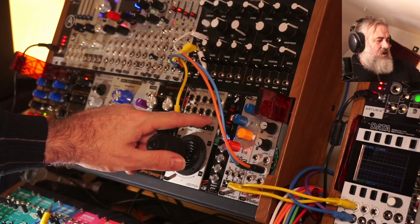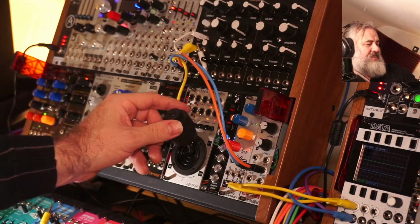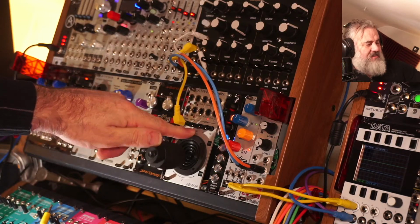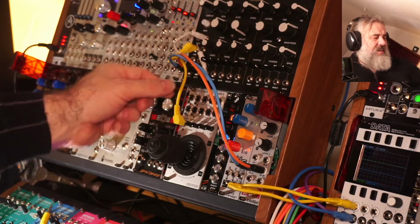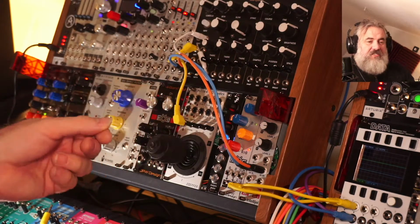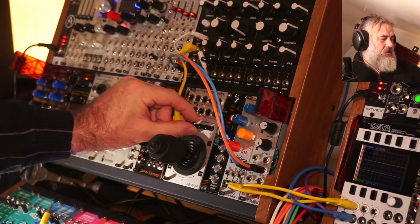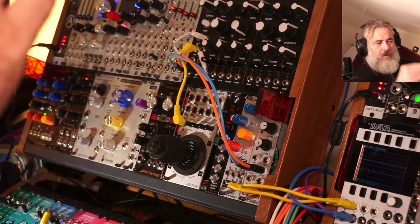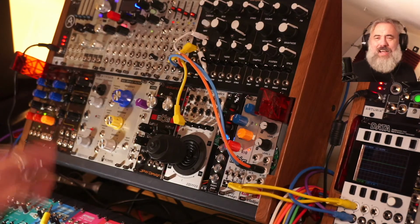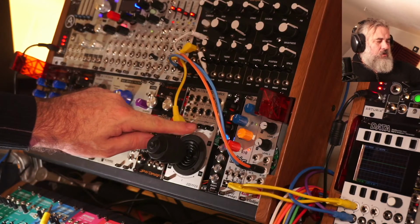Just going through these things, it's kind of cool. As we can increase, it'll decrease, in two directions, so it makes it much more versatile. Then what we've got underneath is offset. That's kind of cool because it works on the idea that if it's sending out bipolar, and you want it to control VCAs, for instance, going from nothing to full, then you can use these offsets to add extra voltage to those outputs. So it's not going from minus 64 to plus 64 or the equivalent, it's going 0 to 127. I'm using MIDI terms there, but that's the principle. So that's what those offsets are for.